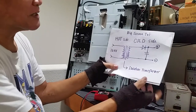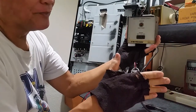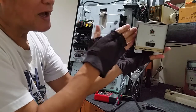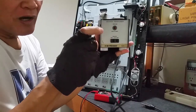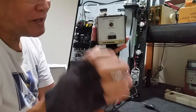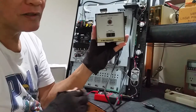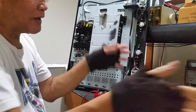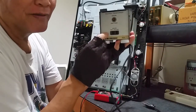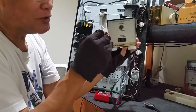So I will repeat it for the last time. If you are troubleshooting any big screen television, you should use an isolation transformer, so that it will act as your firewall separating you from the utility line while you are troubleshooting. This is an isolation transformer. That's the importance of isolation transformer — this is the one protecting the lives of technicians while they are troubleshooting. Without this, don't be brave. You should have an isolation transformer when measuring voltages in a live circuit.